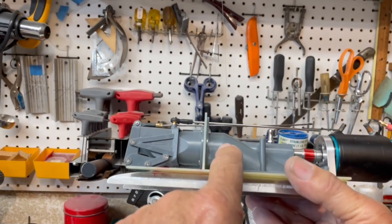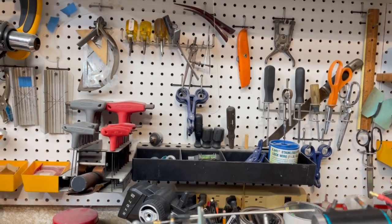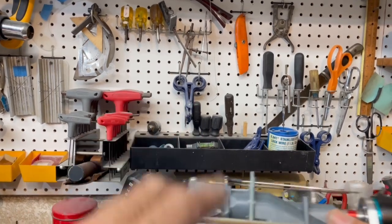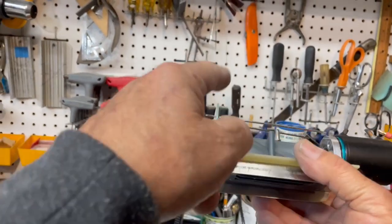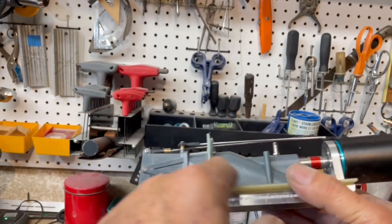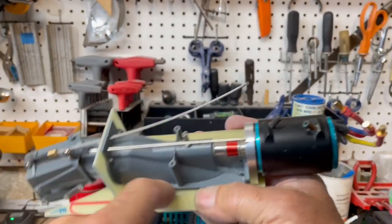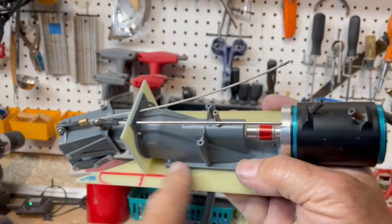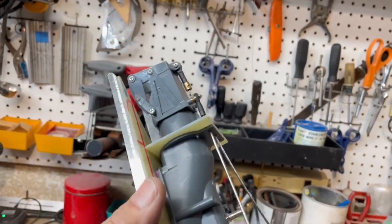The way these pumps are designed, they won't fit in any molded hull. I don't care if it's plastic, if it's fiberglass, if it's carbon fiber — because all those hulls are not going to have perfect 90-degree angles like this thing is designed to fit. It's also designed to fit on a perfectly flat surface, and how many boats have a perfectly flat surface?